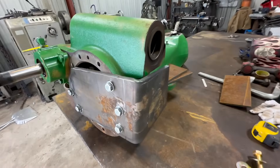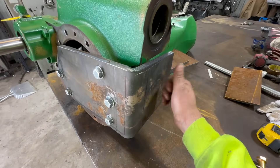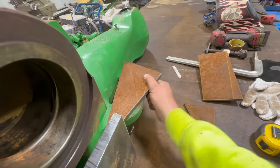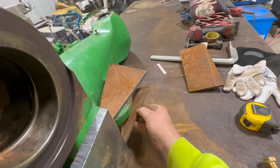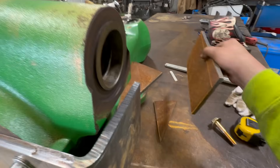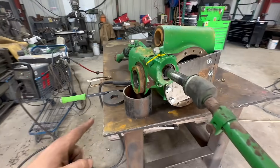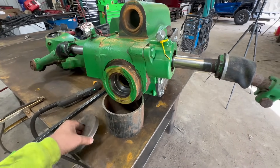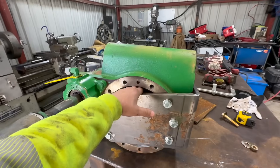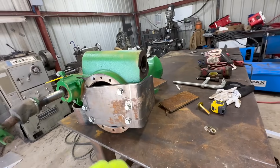After looking at this a little bit further, it vibrates a little bit when you tap on it, so I don't think this alone is going to be sturdy enough. I have some pieces of scrap here and basically what I'm going to do is cut a hole in this, pinch them together with a bolt, and then weld another piece to it. I also just realized I need to do this side first because I'm going to put this on the inside with a bolt and a plate out here — with my plate on, I cannot get my hands in there. So we're going to take this off, do that side, and then come back to this side.